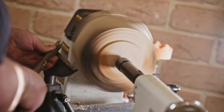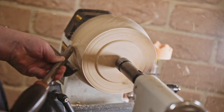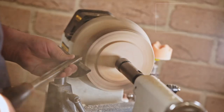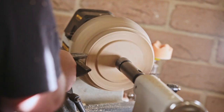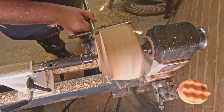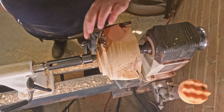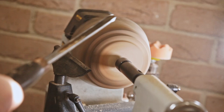Now I know there's already a loose section on the top, and as you may notice, there's a new addition to my floor — I took a nice chunk out from the piece on top. Going back to using the long wings and pulling in that top. You may notice that I'm still riding my tool a little bit higher than the centre — that's called laziness. I should have dropped a little bit more, it would have cut a bit better, but it was already cutting fine because it is such a softer, forgiving wood.